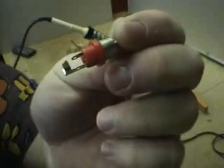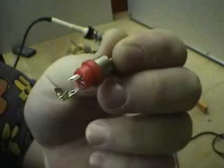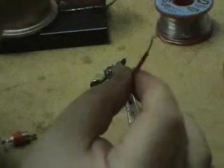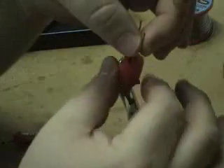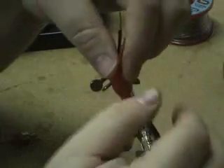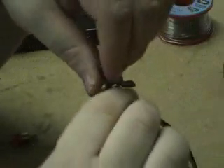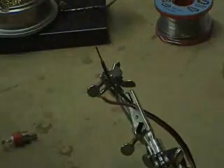We've still got a hole in the middle, so through the hole is where we're trying to go, and of course you've got a small space to work in. You're trying not to short out the circuit by joining the wires together, or overheat the whole thing while you're soldering and have it melt in your hands. The sheath is going to go across the two wires, so poke them gently through the sheath the correct way around, so that when you bring the connector on, it can come back up and screw gently on.